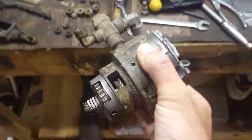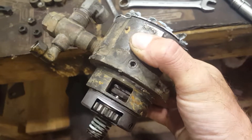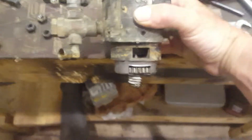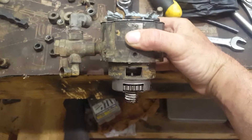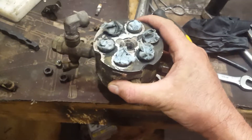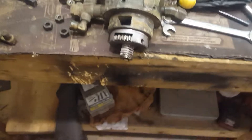As you can see here, that spring is fully compressed and that plunger is stuck in the up position. It's stuck because it's gotten seized from varnish inside of that fuel block — the spillport plate — and probably seized in the bore the same way. When it just sticks up and won't come back down to be pushed back up for the next stroke, it still spins with the gear to distribute fuel to the other sections, but being as it's not traveling up and down it's not producing any high pressure pulses through the lines when it's supposed to.